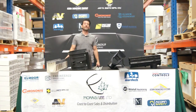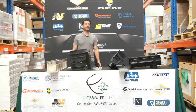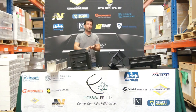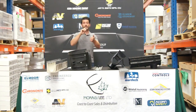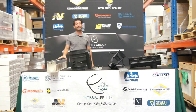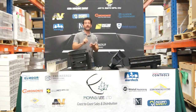The third system is the 9660, which is an all stainless steel unit. This system is used in food processing plants, micro breweries, and laboratories where sanitation is of high priority. The channels can accept a lot of chemicals and high temperature water used to wash down equipment after use. You still need 4 inches of cement all the way around for a proper install, and it is available in light duty to heavy duty grating.